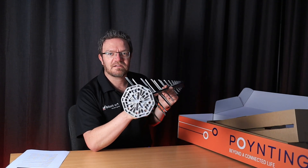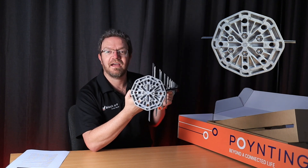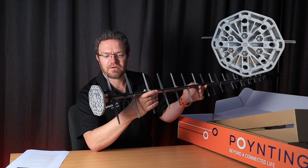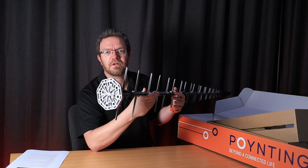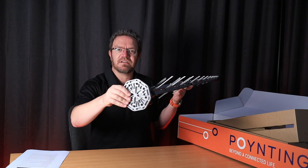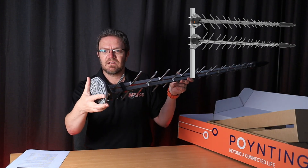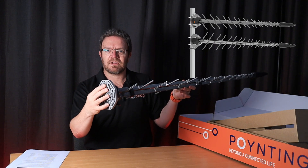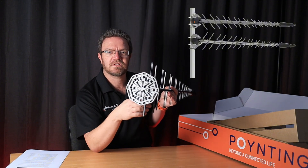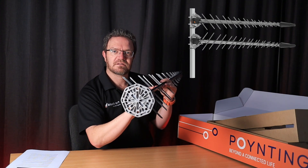The beauty of this one is the bracket at the back. There are eight holes all aligned, so you can mount this antenna in any orientation. For a 4G solution, you want two-by-two MIMO, so you can mount one antenna at a 45-degree angle and the other antenna, using the same bracket, on the same pole at another angle — plus and minus 45 degrees. Because the bracket supports vertical and horizontal as well, you can go vertical, horizontal, or 45 degrees plus or minus.